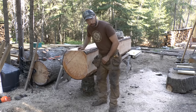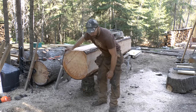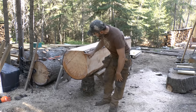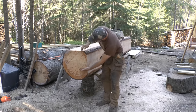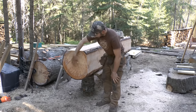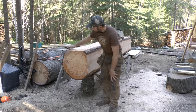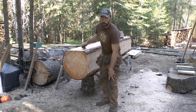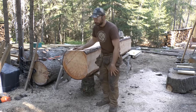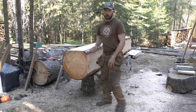I'm looking for about 14 and a half inch boards, and I want those boards to be centered in the nicest wood here so I can get the greatest number of 14 and a half inch boards. Anything outside of that 14 and a half inches isn't waste — we'll get boards out of that. We call those second cut or third cut boards, and they're going to be live-edged both sides. You can either use them like that, or I just snap a chalk line, square them up with a circular saw, and process them later. So I'll drop the saw to 1 inch and I'll produce a 1-inch board here to get down closer to my intended line.